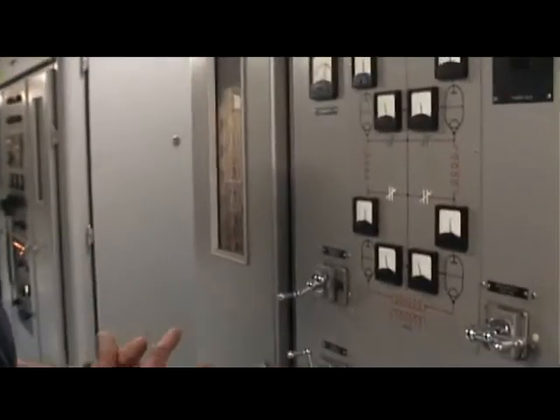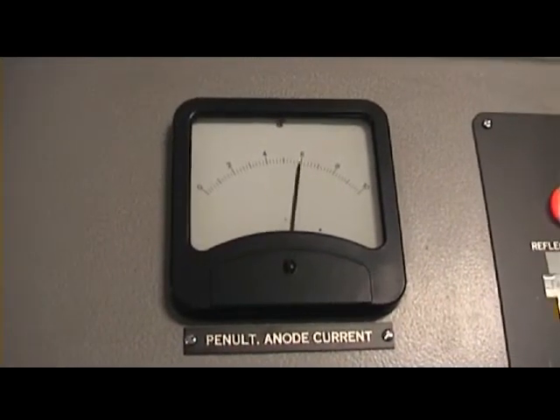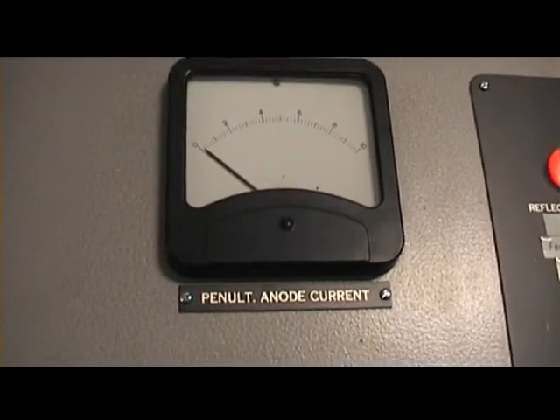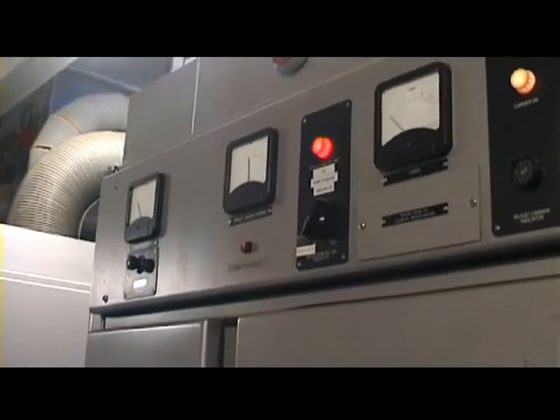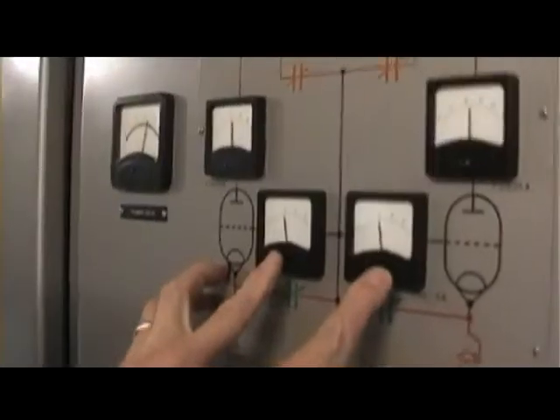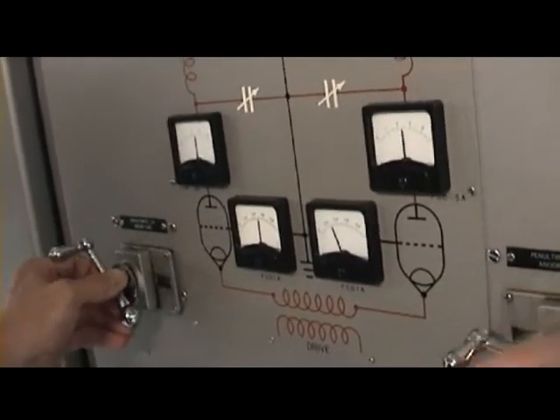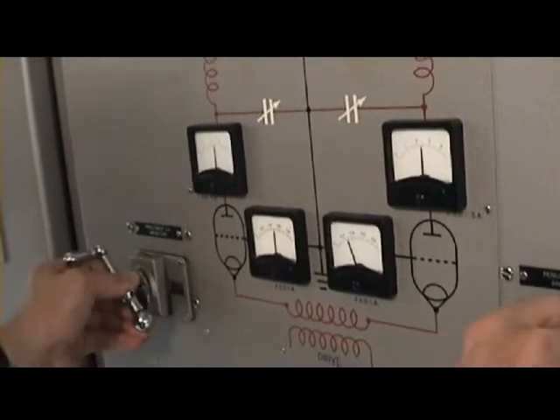Here we are on the final stage — we're going to do a manual tune-up so you can see the meters move and see what we have to do to tune the transmitter. It's actually tuned, but we'll give you a quick demo of how it works. So the pen stage first — like most amps, minimum on the anode feed, maximum on the grids. Let's have a look. Oh dear, I didn't like that. As you were — keep it running. That's the pen stage tuned: just over four amps on the anode, just over two on the grid. We also look at the pen to see that they're balanced — just alter them slightly, get them about the same. Nicely balanced, grid's balanced.